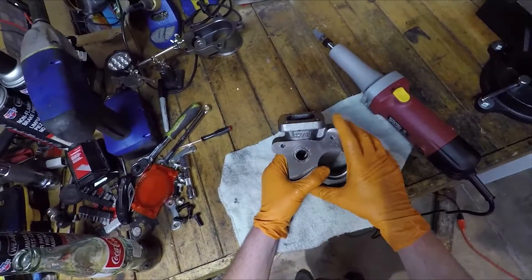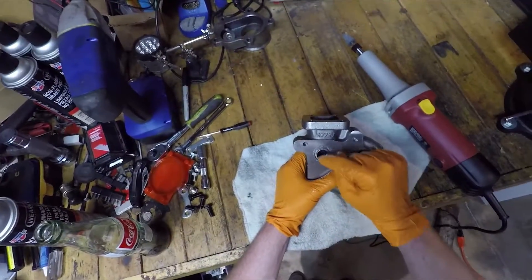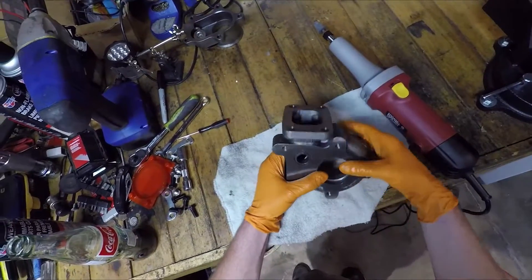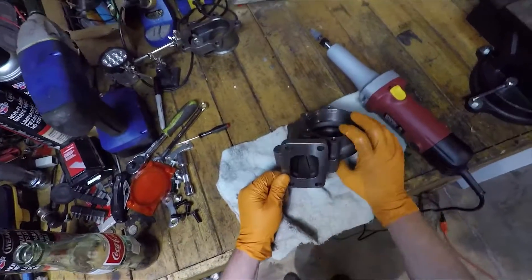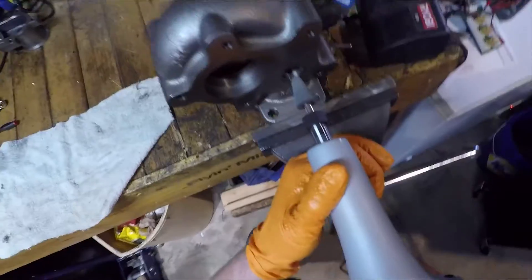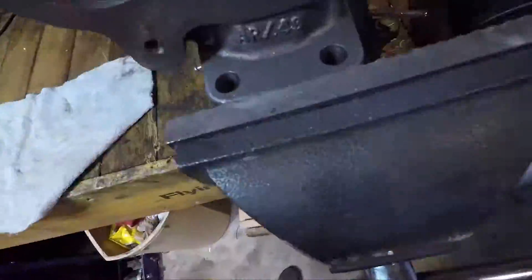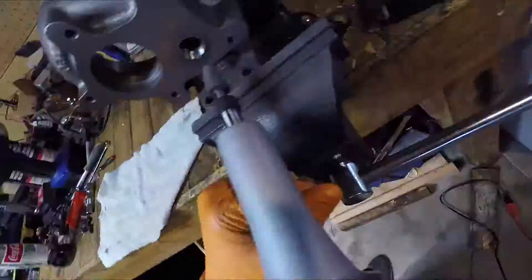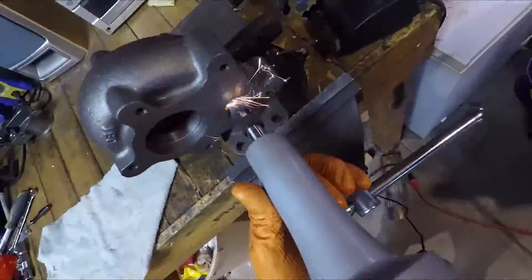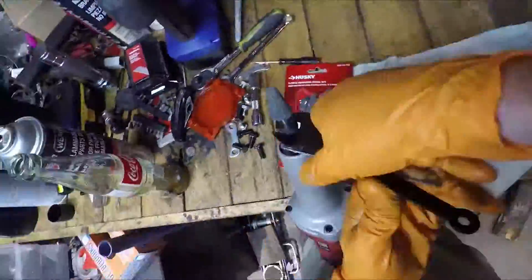Basically what I'm going to do is hog this out to that little Sharpie line I made. You don't want to go all the way to the edge of where the grease was from the flapper — you want to be just inside of it, one or two millimeters, maybe a little bit more. Otherwise it might leak around the side, so you want a good seal. But we can increase that a good amount, and inside here is really simple — we're just going to make a little channel.